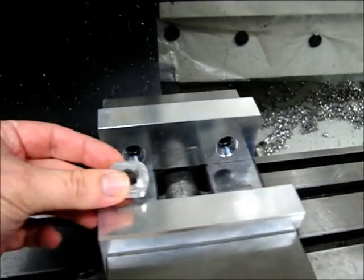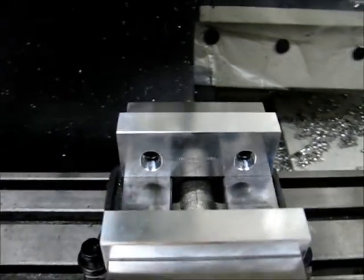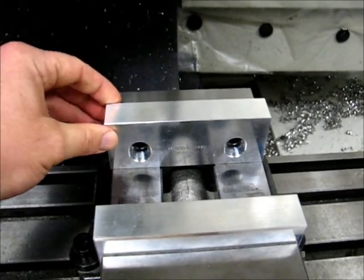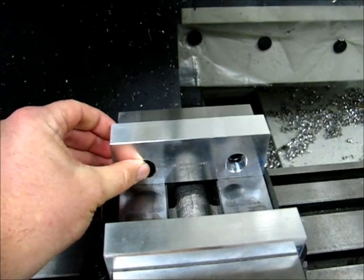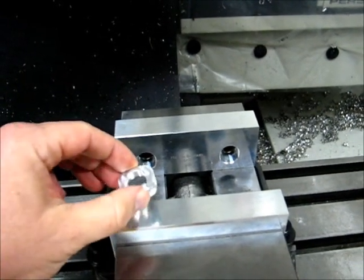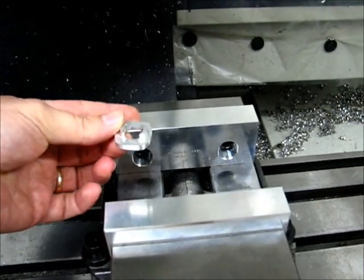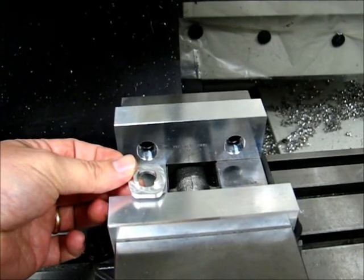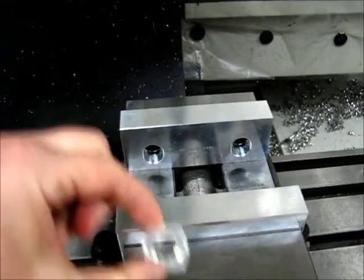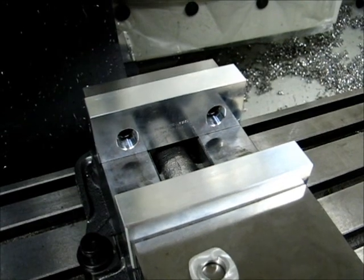Because I am holding the parts on opposite sides, there needs to be some alignment between the two. I figured the easiest way to do that, for the purposes of holding the parts once these are machined, is to machine them in there in a center position, somewhere halfway between the sliding position. Then when I'm tightening the vise down the first time, I'll hold the part in place to align from the fixed jaw side to the moving jaw side, and once the two are aligned, I'll tighten up the bolts on this side.